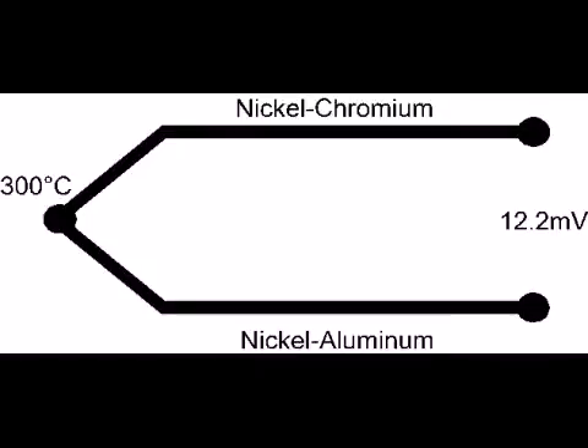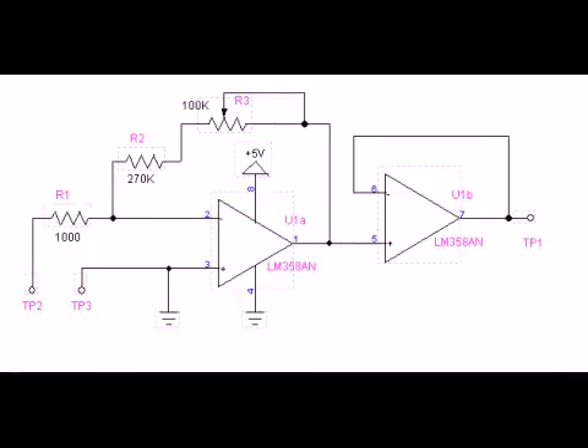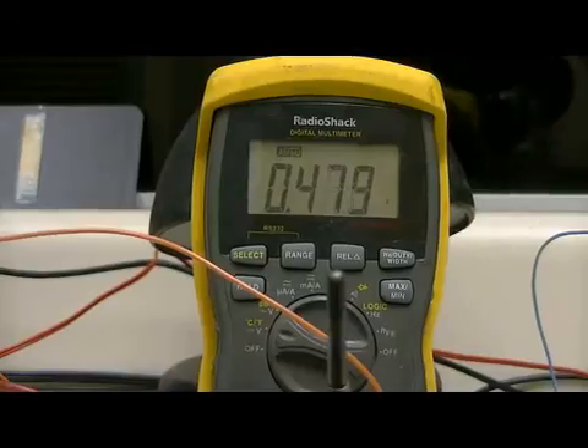That's far too small to be used to measure on an A-to-D converter on a microcontroller. The amplifier that I've designed and built uses a single LM358, which is a high-gain op-amp. We will move on to an actual operation of the circuit, and my website explains its calibration.